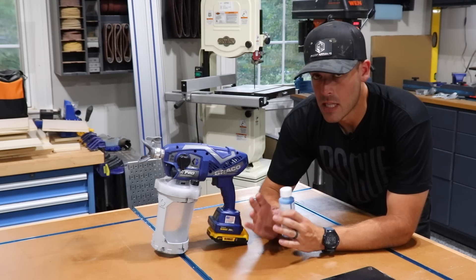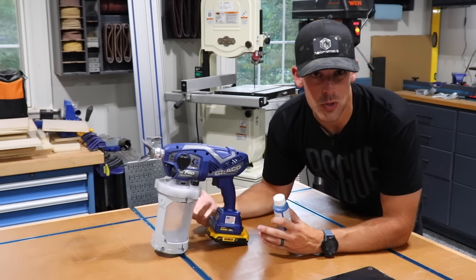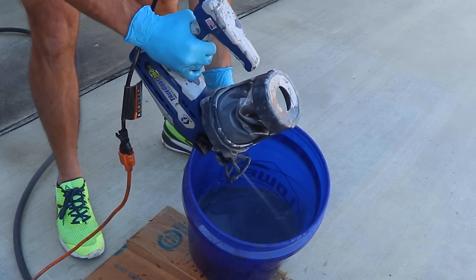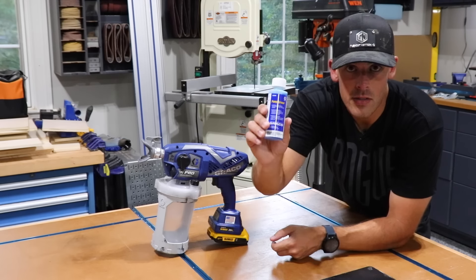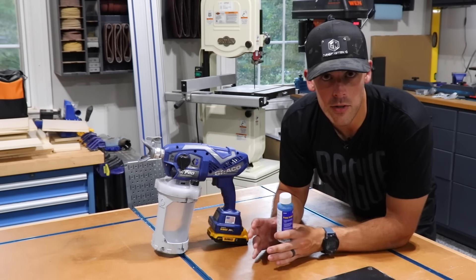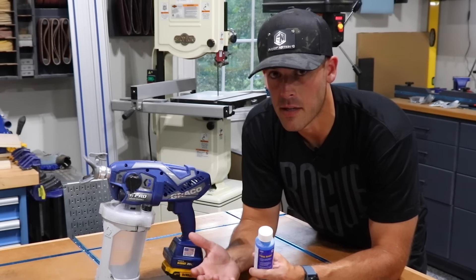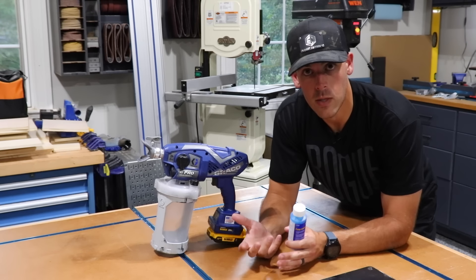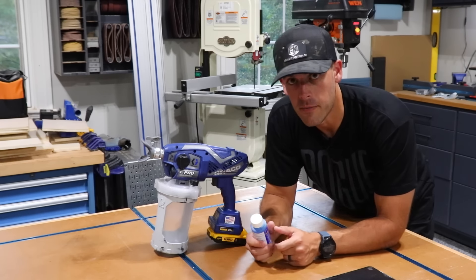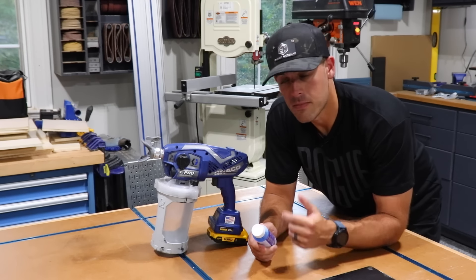The fourth dislike revolves around cleaning. In reality, this thing is actually pretty easy to clean. I use a lot of latex, which is water-based, so I just rinse it and flow water through until all the paint is out of the internals, then use a product like Pump Armor to preserve the internal parts. My issue isn't that it's hard to clean, but from what I understand of bigger airless sprayers that professionals use, it takes basically the same amount of time. So you'd think because it's smaller and simpler it'd be really quick to clean — but not necessarily.